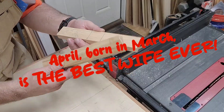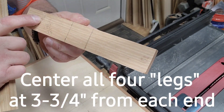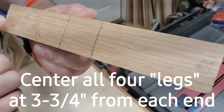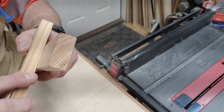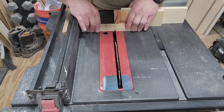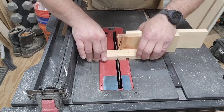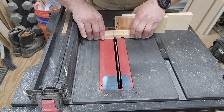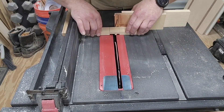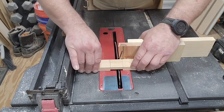Time for mathing. If your legs are nine inches long and they're an inch and a half wide, then both of the cut points will be in at three and three-quarters, so that you can go in and remove this material. Got to do it to both of them, obviously, and that way they fit into each other.